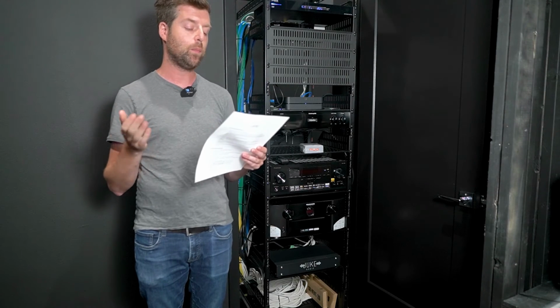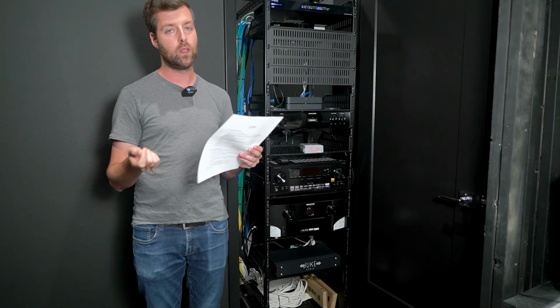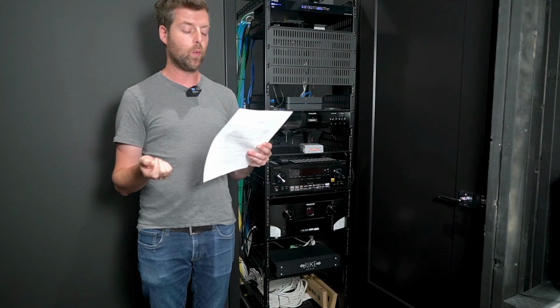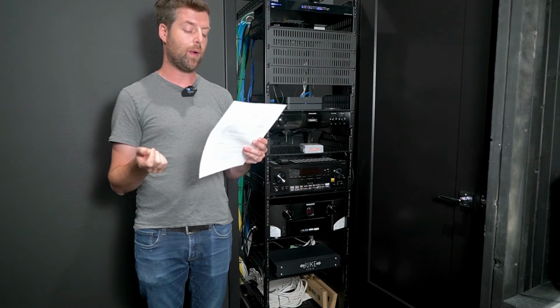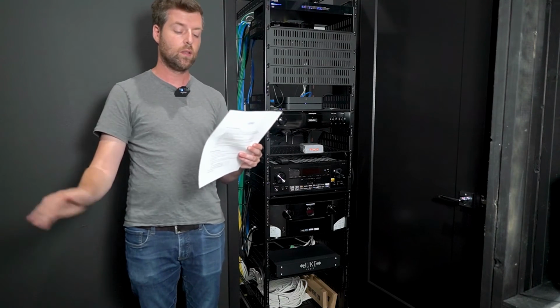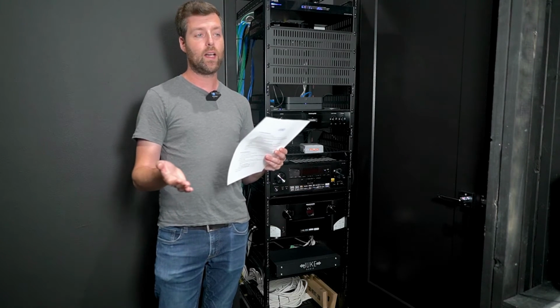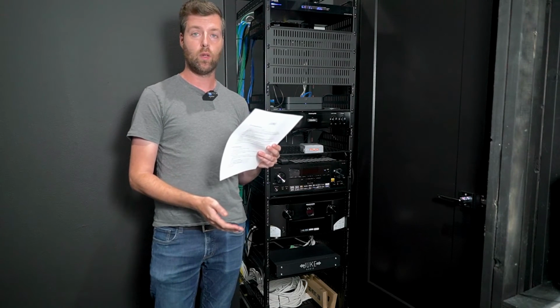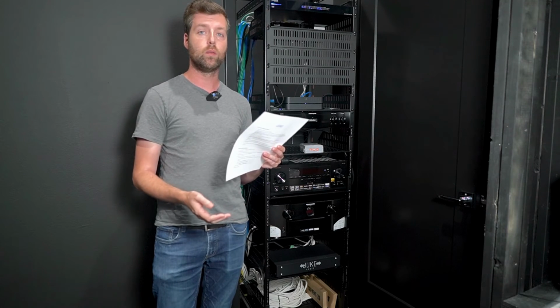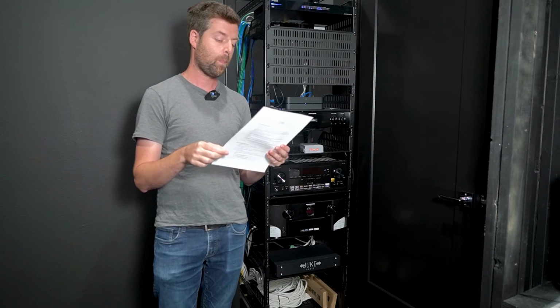As I mentioned, the amplifier power isn't all that great. So it's 40 watts peak per channel, 80 watts peak per zone, but the RMS power is really only about 20 watts, 40 watts per zone. And the aggregate output power of zones operated simultaneously, in other words, what you get across the board, is 400 watts peak. So one of the reasons why I said if you've got a lot of speakers and you have the extra zones, I would just use those by plugging individual speakers into those because you'll get more power that way.